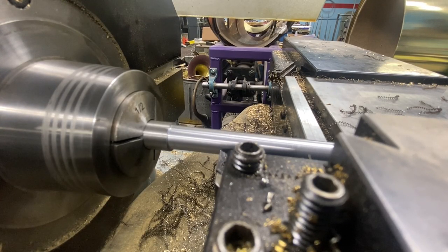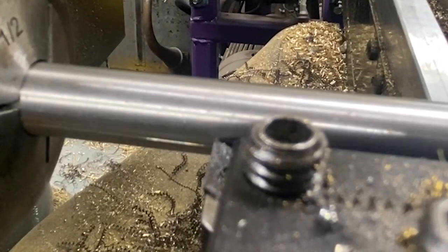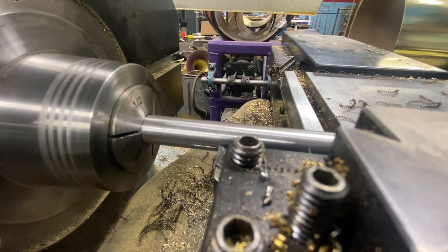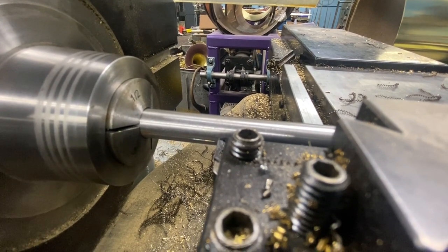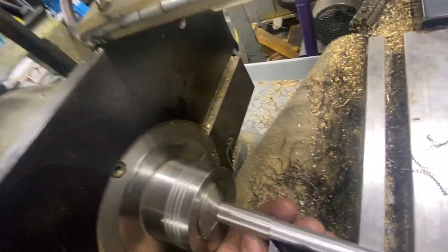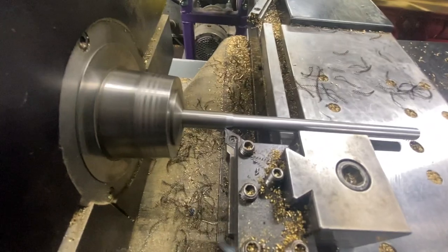That's not good at all - I went too far. So I think that tells me I need to move in my stop. It sucks, but it's okay. Tip of the tool looks okay. It's just because the material fits in the collet loose - we should be okay. That's something I've got to alter. Right now it's going to 0.475 at that stop; I'll make it like 0.450 or something. I wanted to make them all the same just for the sake of whatever code Jeremy's going to write. If I make them like 0.455, they'll all fit - 20 thousandths should be enough to account for that.